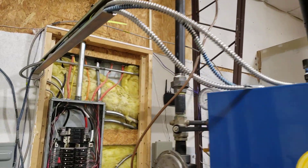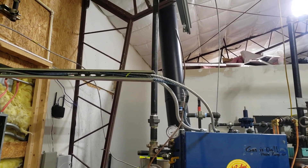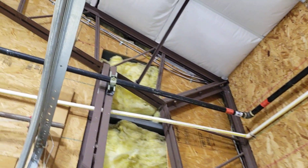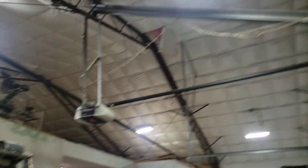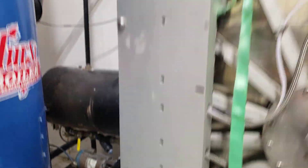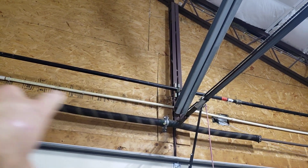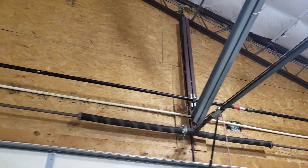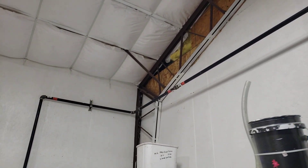You also need to sort out your fuel. You can run natural gas, fuel oil, or propane — I went natural gas since I'm close to the grid. I also want to mention unistrut: this was one of the first jobs I used it on and I'm in love with it. You can use it as braces, stands, or to wall-mount additional components. I wish I'd used it earlier — I could have had electric, water, and gas all routed on one unistrut.